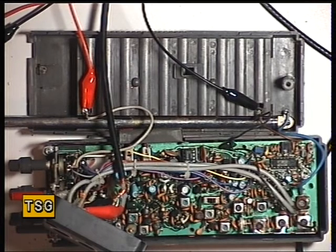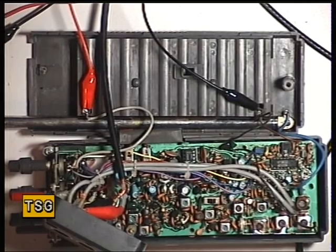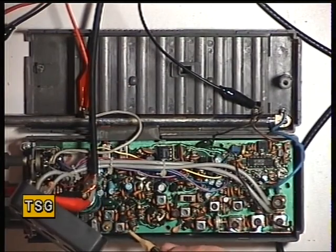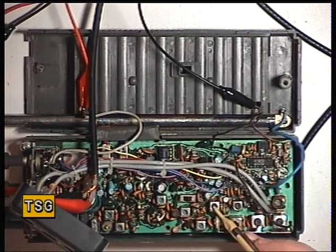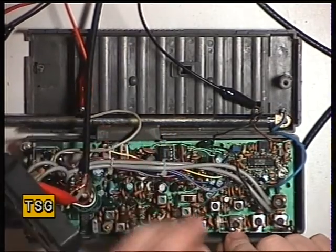But on this occasion, the MPSU31 transistor, which is a Motorola device used in these, I couldn't even obtain these 30 years ago. And occasionally, you know, you see scrap chassis available, and we'll buy them up. And fingers crossed, it's a working device. And in this case, the scrap chassis had a working part. So our first transmit coil is that one there, and that's T6. So I'm now going to go into transmit.